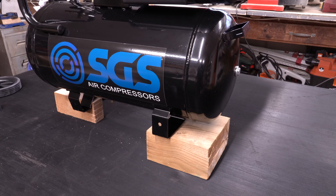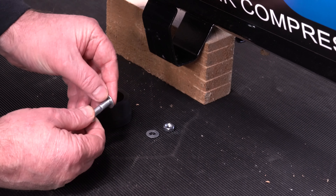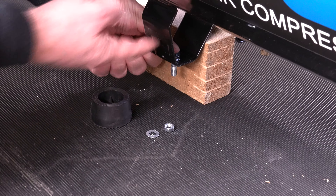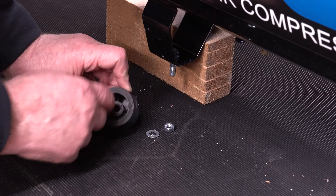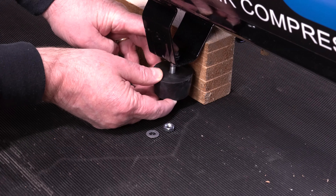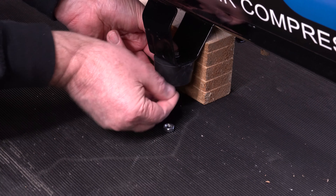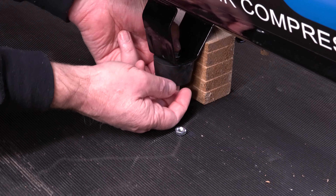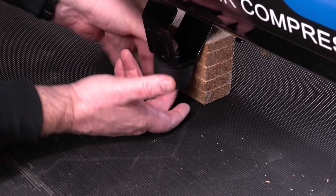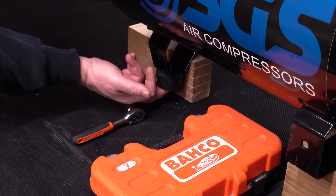In order to make it easy to fit the wheels and the rubber feet, I've propped the compressor up on two pieces of wood. For the rubber feet, we've got the rubber foot, a bolt, two washers and a nut. Take the bolt and one of the washers and slide that down through the hole in the fixing. The rubber foot has a hollow centre — that goes to the bottom, facing downwards. Slide the rubber foot up and over the bolt, then slide the washer in — this is quite fiddly. On the tip of your finger slide the nut up until you feel it touching the bolt thread, then turn the bolt from the top so the nut locates on the thread.